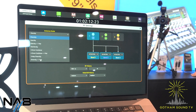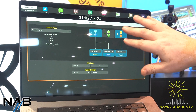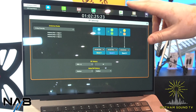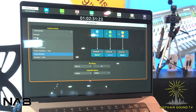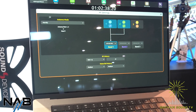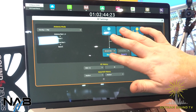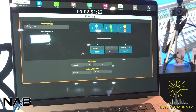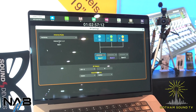If you want to segment off with a different antenna — say you've got an STL band antenna here and you want UHF — you can have a tuning band for STL and another two for UHF. You could even split them off so you had a VHF antenna, UHF antenna, and STL. If you want more robust coverage, you can go into what we're calling four-versity, feeding four antennas into a single tuning band so each received channel sees four antennas. We additionally can add a diversity zone for something mission critical, and if you want to feed all six antennas to a single tuning band, we're calling that hexversity.